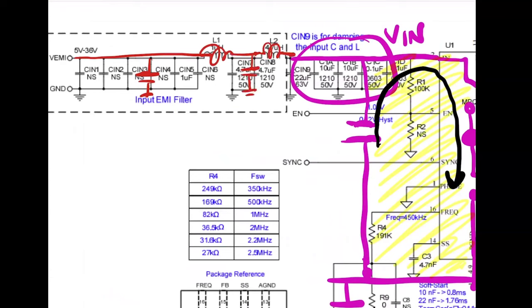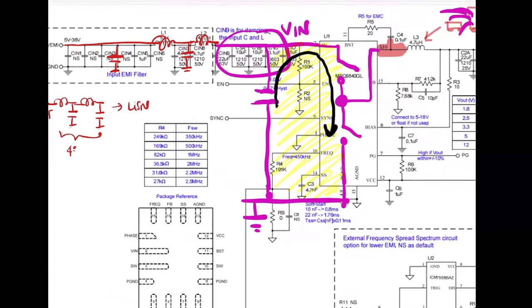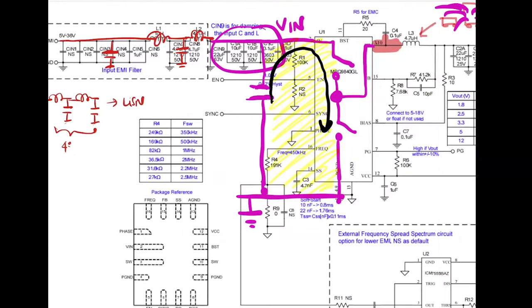So it's a second order filter if we plot from the device under test. No, this is the device under test. If you use a fourth order filter, you will get several advantages. The first one is that for each component, you have 20 dB per decade of attenuation.